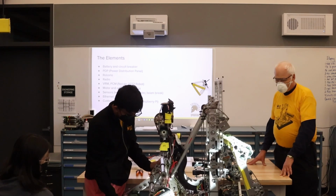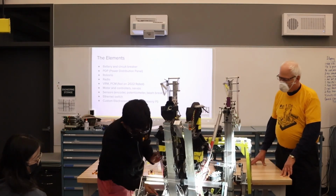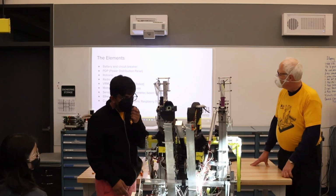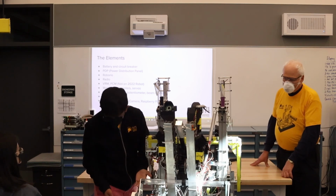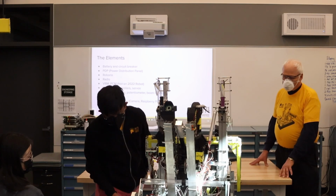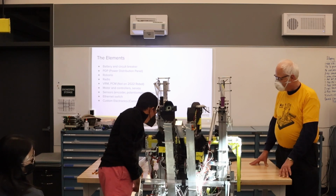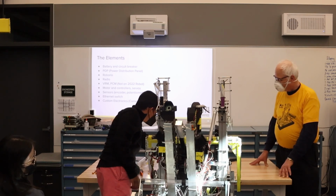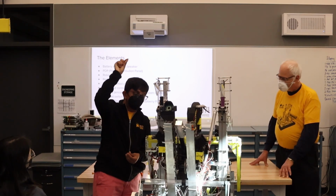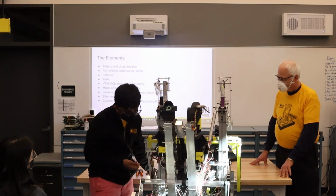Our PD board is right here next to our Rio. It's open simply because there's not much that can actually get broken off of it. We use VHB to stick it back onto the belly pan, and instead of putting just the raw wire into the Wago slots, we use ferrule crimps. These are called ferrule crimps. They're basically circular and fit on top of the wire. It's just a convenient way to manage the wire.